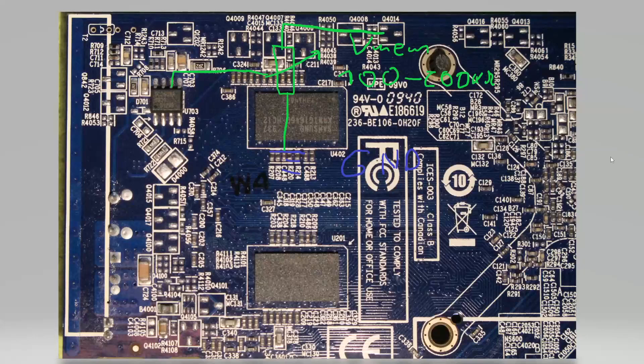That's why it would be pretty elegant if you are not sure if you want less than 1.8 volts or more than 1.8 volts — you can do both with this. There are no switching frequency mods or fancy mods of any kind basically with these cards. It's just either you voltmod it like I showed here, or you just straight epower it — which is kind of nice because it's really simple to do. Anyway, that's about it and I hope this helped. I wish you a lot of fun in the CheapAsChips round two. I might actually be participating in all three stages this time, hopefully.